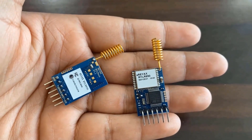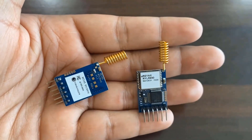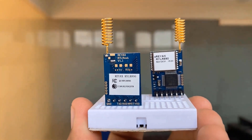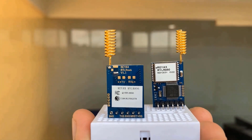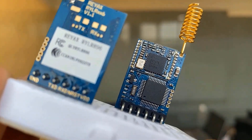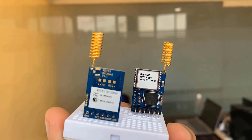The module is breadboard friendly and operates between 2.8V to 3.6V. It has a very small copper antenna with greater noise immunity for long distance wireless communication. You will need at least a pair of LoRa modules for establishing wireless communication. There is a list of AT commands that can be used to perform tasks like sending data, receiving data, or putting the device to sleep mode. You can learn more about the AT commands from the technical documentation, which I have attached in the website article. In this video, I have assembled the LoRa module with Arduino Nano on a breadboard. You can also use a custom designed PCB for this application.